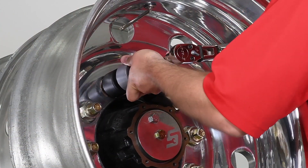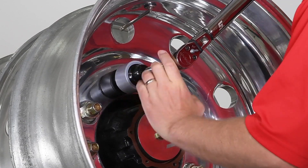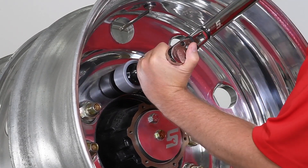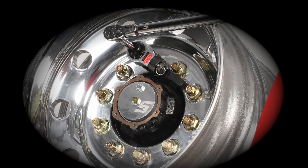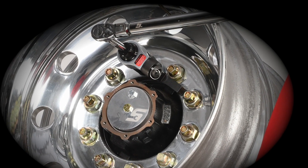When the multiplier is assembled and you have your torque wrench ready, the assembly needs to be positioned so that the reaction fixture is against an appropriate blocking surface. Always keep in mind that the reaction fixture turns in the opposite direction as the socket.